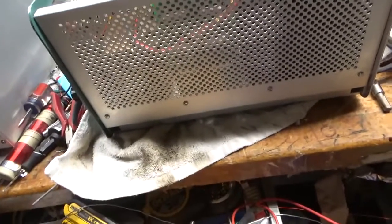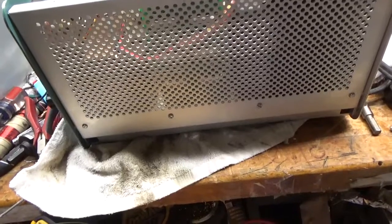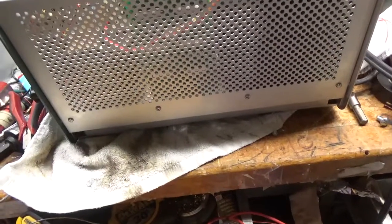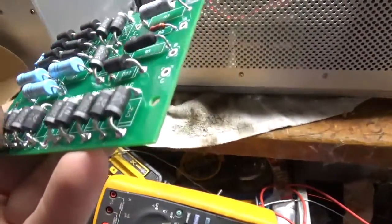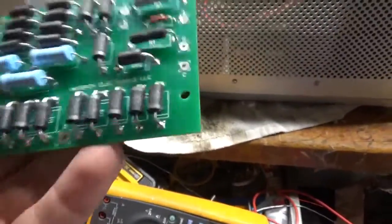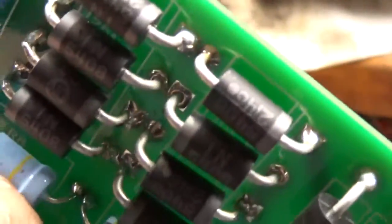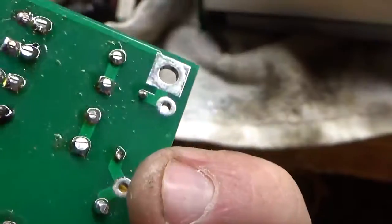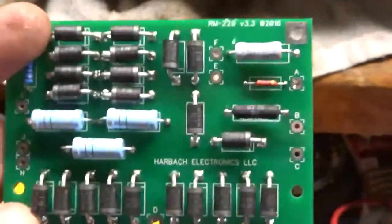I give people credit for wanting to try to do some work themselves, but it's best to just let me do it. This gentleman had purchased some Harbach kits and also some kits from overseas, but I'll only use the Harbach ones — I won't use the other ones. So here's the metering board. It's okay that he stood the components off the board a tiny bit, but the solder joints are not good — blobs of solder. Some are okay, a lot are not. The other side is better but there are still some that are not great, so that will cause me to have to touch them all up, which will take me more time than if I just put it together myself.